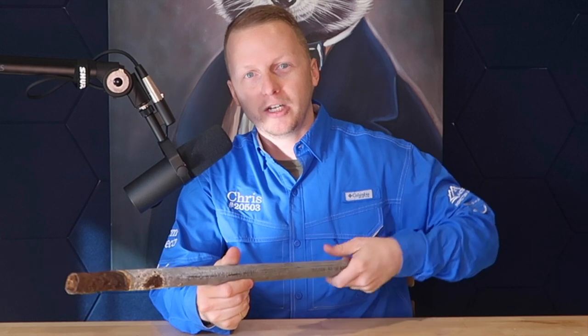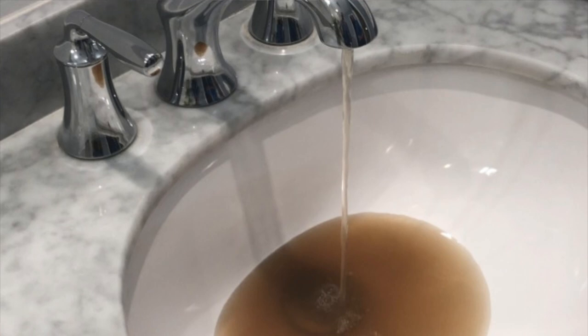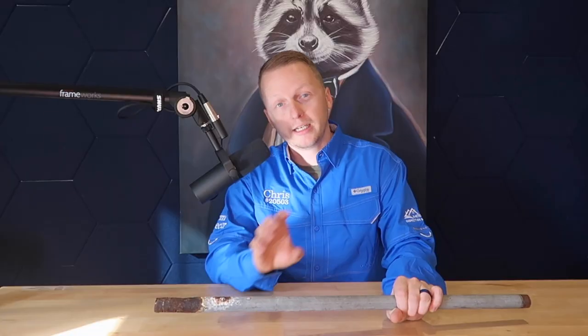This reaction eventually causes extremely low water pressure, normally on the hot water side of your property, and it causes your pipes to eventually develop little pinholes and could eventually cause them to explode. The plaque buildup also causes your water to be unsafe to drink and eventually causes extreme discoloration in your water. You'll pour a glass of water and it will look like a rusty snot mess.